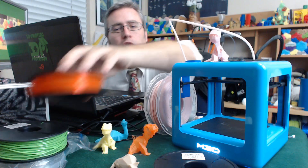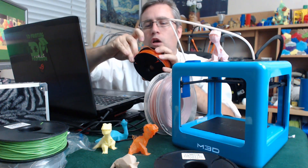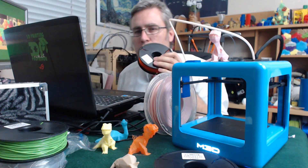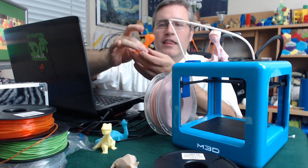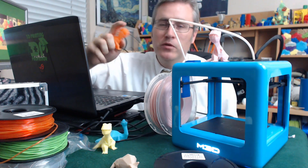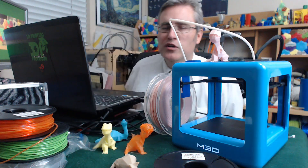They also had a transparent, flexible filament they're calling Tough Ink. But if you try to print with the code printed on it, it uses the wrong settings. If you use the setting FLX for flexible filament, it prints just fine. I printed a flexible, squishy low-poly T-Rex with it, but it didn't work 100% well — we got some zombie-like holes in the head, and a weird fin on the back from a sacrificial tower. I'm not done with their flexible filament; I still get to play with it.